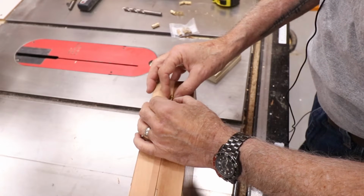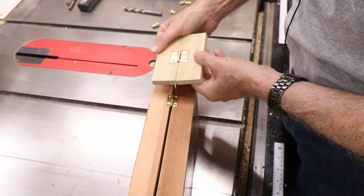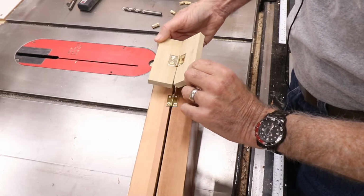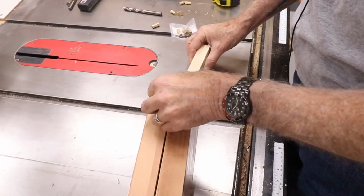So the way I'm thinking about doing this is putting the hinges like so, a 7.5 inch piano hinge if I use it, and inletting it so it's nice and smooth. And this is basically what we have here. Now, in this test piece, when I open the box and lay it on the table, this seam is going to close up nice and smooth.